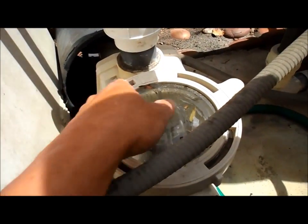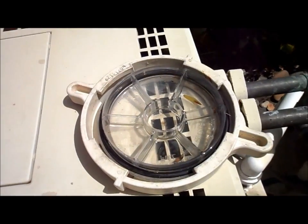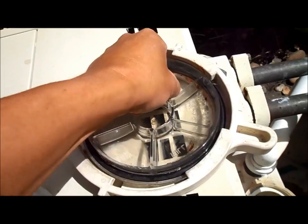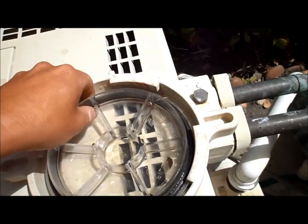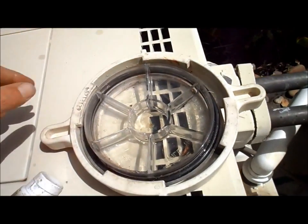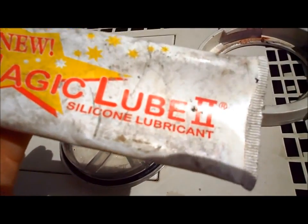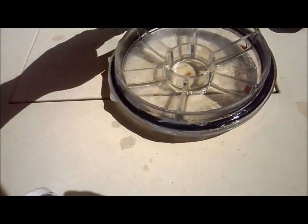Another thing that could be the O-ring and the lid, and I'll show you a trick to see if it's the O-ring or not. Let's say the water is still draining down when you turn off the pump and it's not holding. And you check the pipe to see if there was any leak and you did not find one. So the next suspect would be the O-ring. One thing I like to do is put some silicone on to make sure that it's the O-ring or not. You just slide the lid out of there, and you can use any kind of silicone — it will eventually just dissipate. And put some on the O-ring so the whole O-ring is covered with silicone.